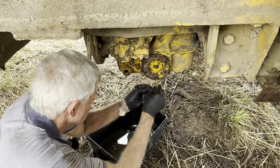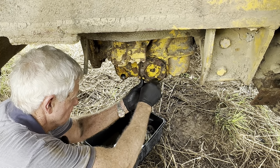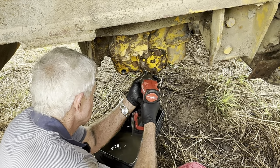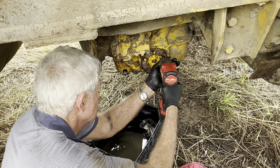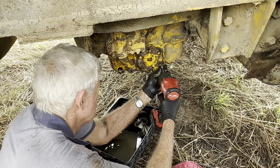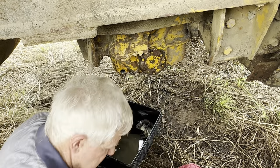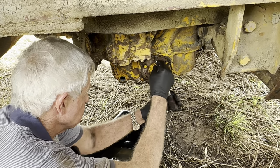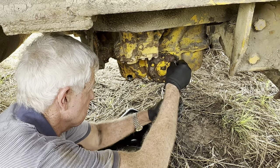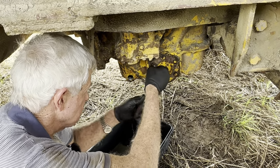Some of these were fairly tight, so I'm not quite sure which ones were where. Right, I'll go back to my rattle gun, I think, and I'll just get them all started with a bit of grease. Check them all by hand. They're all going onto a tin plate, so anywhere I see tin plates, I think, well, you can over tighten them, buckle the plate, and when the plate's buckled, then it'll probably leak. So sometimes it's better just to do these things up by hand, you get a better feel. Or I do anyway, I'm old school.